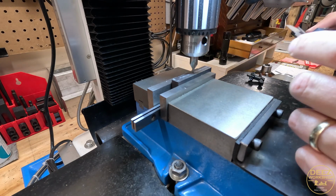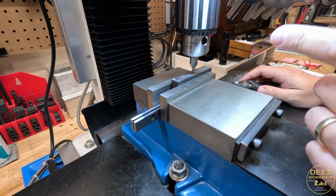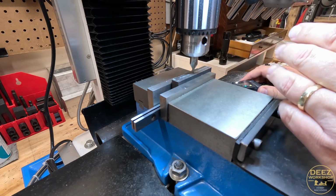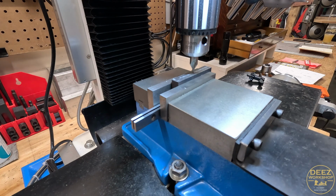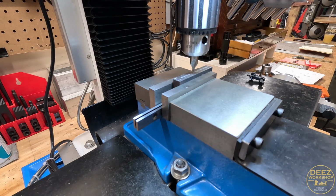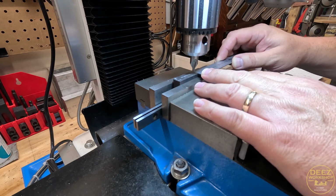I'm glad I paid attention to that. All of this is about learning on this channel. That's what I'm doing. I'm continually learning. So with those edge finders, you have to add the 100 thou. So I need to add 100 thou. And again, that should be 1.5 inches over. And it most certainly is.